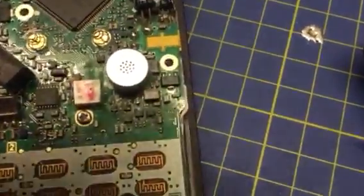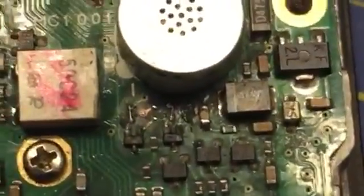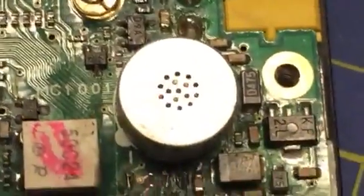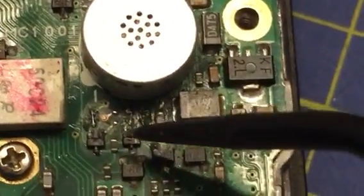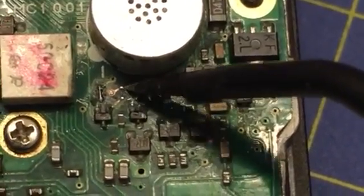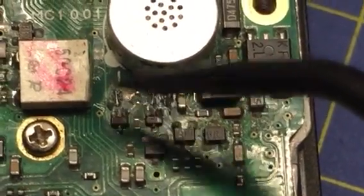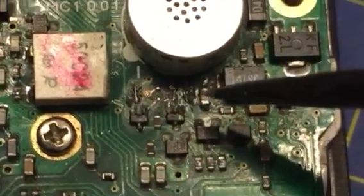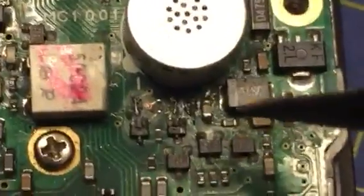Okay, the mod. Zoom in. I missed this on the remote. There's a chip there, or a resistor. Needs to be removed and placed there. You do need the microscope for this — it's very hard to do, not an easy thing to see. Somebody had already been at this before, mate. The mess isn't mine; I've just tidied it up.